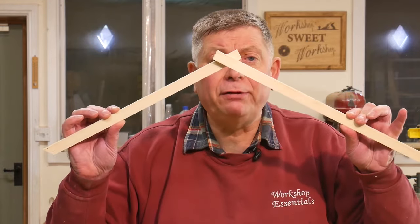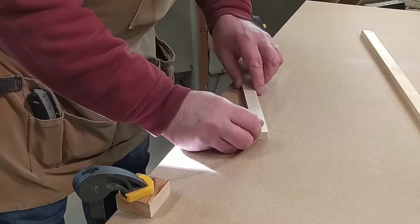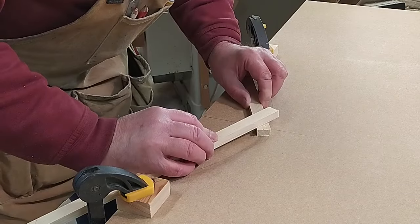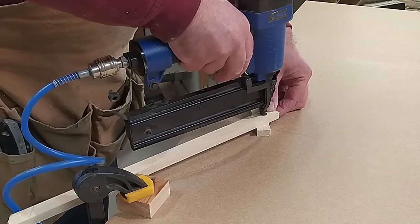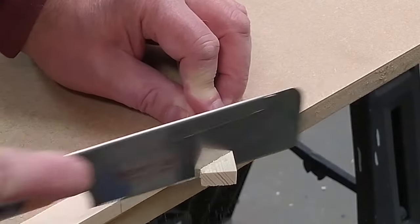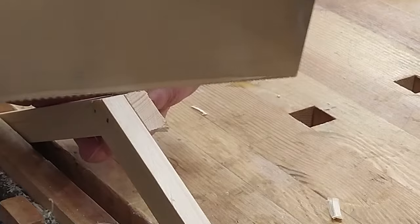But for a circular arc, I've got to join two sticks together in a very particular position. So we put one stick against the block here and my bulge point, and the other stick against the other block and also crossing at the bulge point like that. Keep the overlap to a minimum. There we go. And then we just need a couple of pins. There we go. Then we trim it off, and then we make a tiny notch — just big enough for a pencil lead — right on that corner. And it's ready for use.